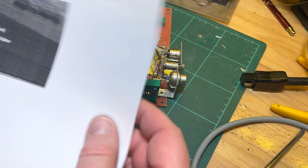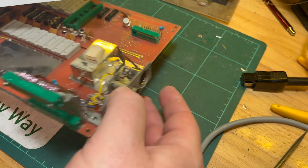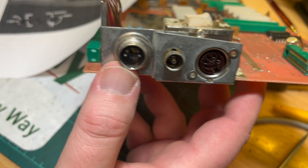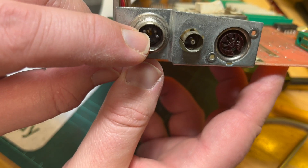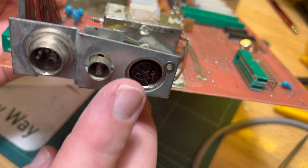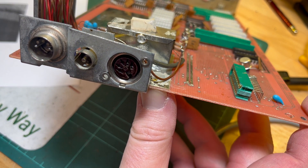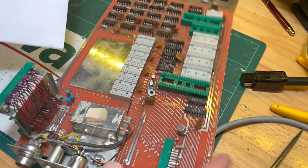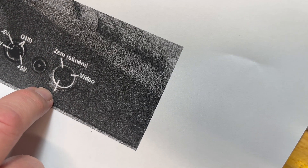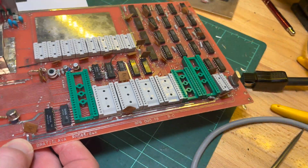This is apparently the pinout - we've got 12 volts, minus 5 volts, two lots of ground, and plus 5 volts. So I'll wire up my adapter accordingly. Apparently there's an RGB pinout but no one says it actually does RGB. This one basically just has composite video - I assume that's sync and ground. It should be pretty easy to get composite video out once I get all the chips back in.